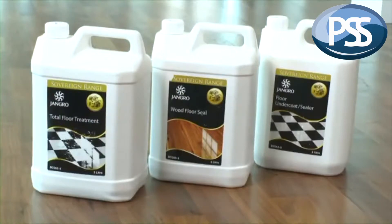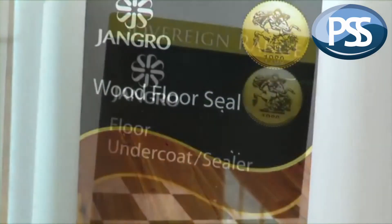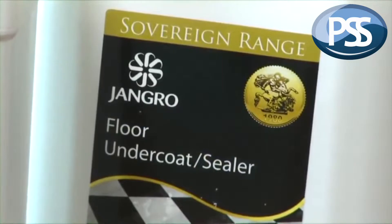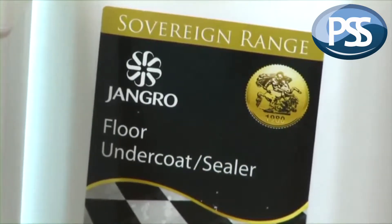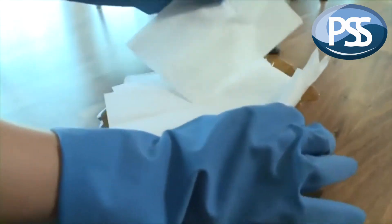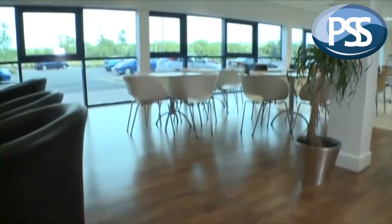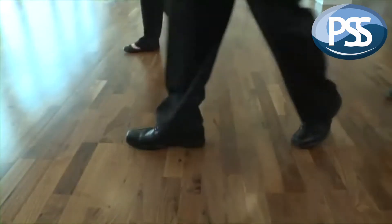There are different types of seal. Generally speaking, we use solvent-based seals for wood and wood-composite floors, which are damaged by water, and water-based seals for thermoplastic, vinyl, lino, rubber and asphalt, which are damaged by solvents. These seals create a resilient layer that protects the floor from solids such as dirt, food and liquid spillages, stains such as drinks and chemicals, and scuffs and abrasions. Seals also enhance the appearance of floor coverings and increase their useful life whilst decreasing the cost of maintenance. Seals have strong chemical resistance properties, meaning that staining agents which can penetrate a surface polish will remain on top of a seal, allowing for better and longer-term protection.